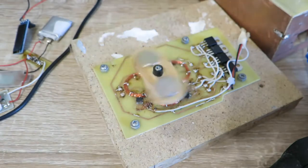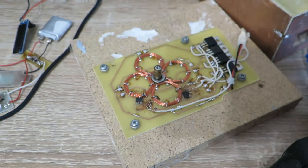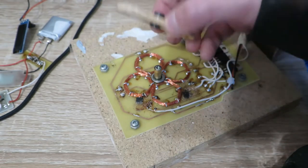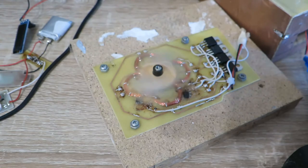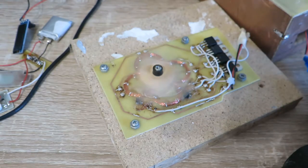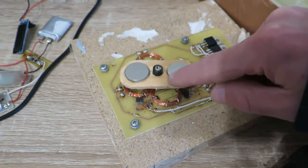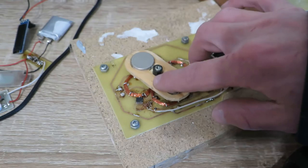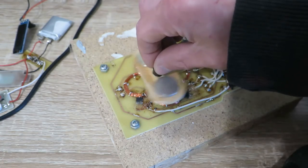But other than that, it starts well. I also haven't used a bearing there, not because I did not want to, but I just don't have one on hand, and I made this basically in one evening. It can be quite fast. I had some lubricant there and it was quite dirty. And this is running on like, I don't know, 2 volts right now, because I have used quite a low number of turns. But it's quite torquey, even at slow speeds.